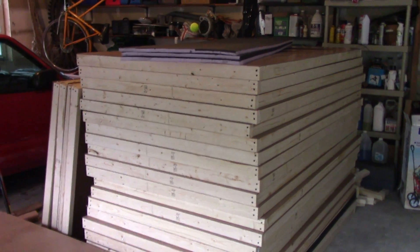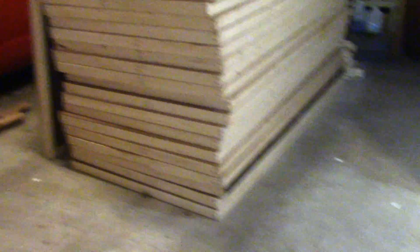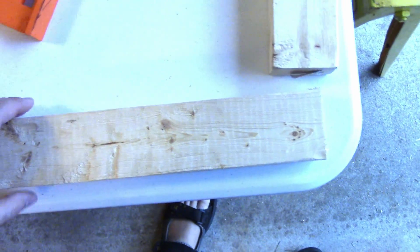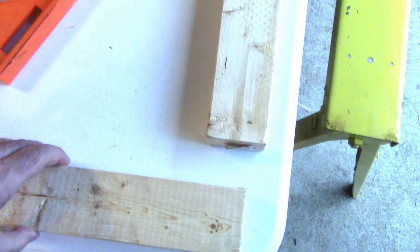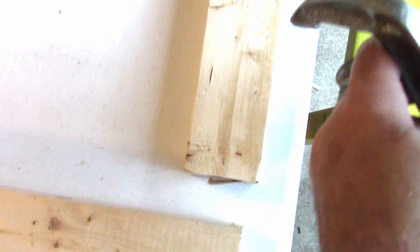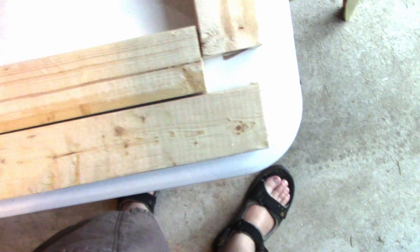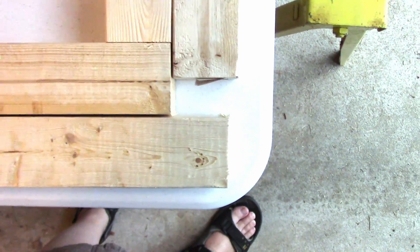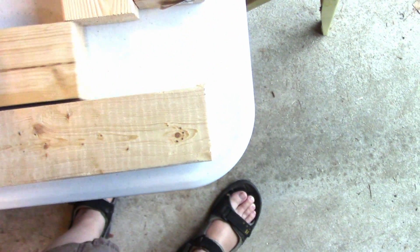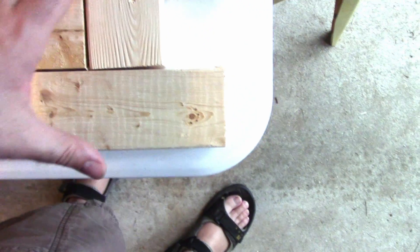Thanks to my mom, my sister, and my wife for helping. For us to churn out that many wall panels in two days, what I came up with was a jig. I took a couple of scrap pieces of the 2x3s we were using, got them all nice and squared up, clamped them down to the table. That way I could slide in the 2x3s we were going to drill together, like this and then like this, and that made sure they were perfectly square. I drilled them in and then screwed them in for a nice square joint.